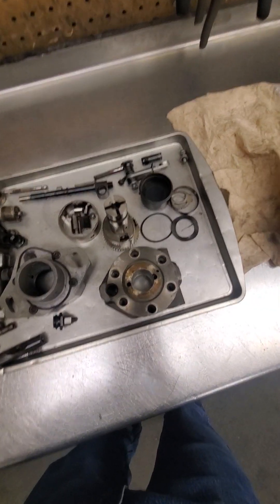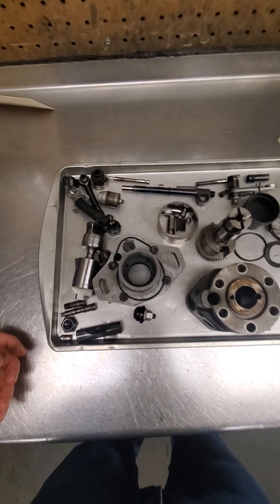These pumps are normally pretty good — they leak — but the biggest problem is they're expensive to work on. CB kits are expensive and you can't hardly get any parts anymore because they've been obsoleted. On this one I'll have to go find that thrust plate on a core. But they're neat pumps; we like the history and we like to keep them alive. If you guys have any questions or need any parts, we are a Stanadyne authorized shop, so we can get you whatever parts are available.